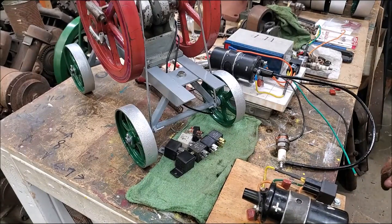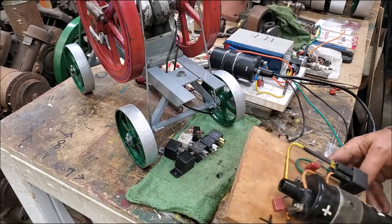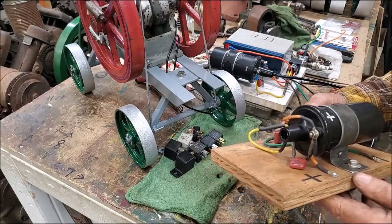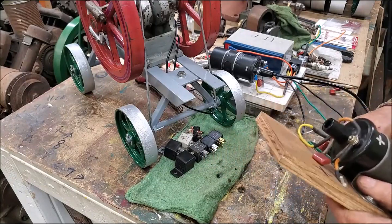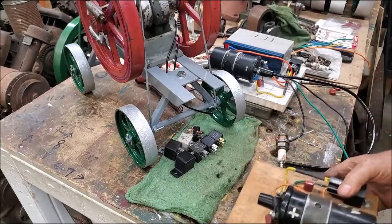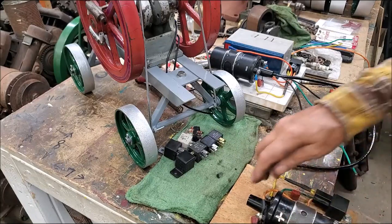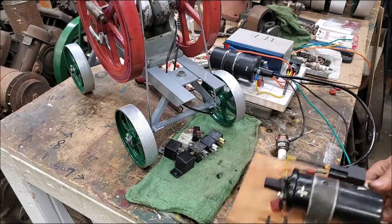This simple circuit right here — it's the same thing — I built this many years ago, more than 10 years ago. You can see on it I had installed that resistor. You can see how many ohms — that's 0.47 right there. I have it wired up to the same schematic as I used in this one. This one has a very nice spark and I've actually run an engine with this right here. You just hook a battery to it and a spark plug wire, and this little relay does everything else. I'll leave a comment out there — I'm here in Middle Tennessee.